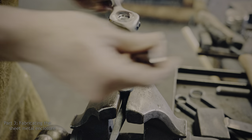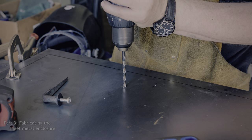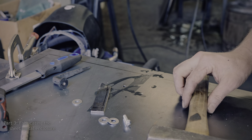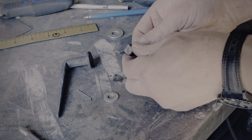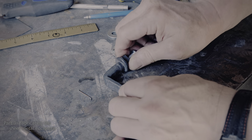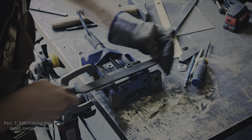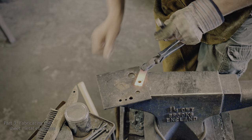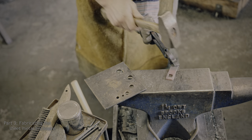As I had already drilled the hole, I now just need to tap it to cut in the threads for the coarse one quarter inch screw. One of the problems with this construction is that the sheet metal, while quite thick, is still pretty flexible. Ideally, I would have a bending brake to bend the edges to give it more stability. The one ingredient that is still missing is a piece of square steel that can move the latch. I chamfered the corners to have more surface area for welding. The chamfers are important as I need to file the weld beads back to the square of the steel and I need enough surface to still hold it together. The square hole for the latch is one half inch wide. I am drilling a one half inch wide hole and will then use more hot work to drift it to square. Drifting is much faster than file work or using square broaches and precision is not really a primary consideration here.